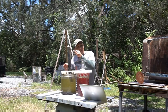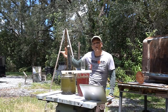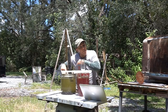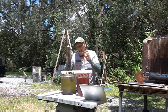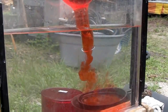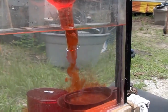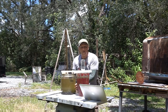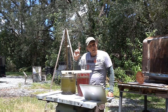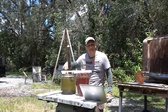The interesting thing about this is that the water inside the tube can get 170 to 200 degrees Fahrenheit. The opening to this tube is wide open to the basin of water. As I showed in another video, water at different temperatures has a heat exchange — cold water falls out of the vessel and mixes into the basin, while hot water stays up in the tube. So the water inside the tube can be 170 to 180 degrees and not mix with the water down below, which stays nice and cool, lukewarm.